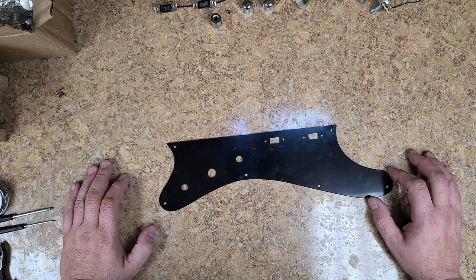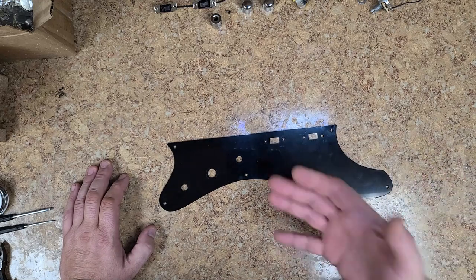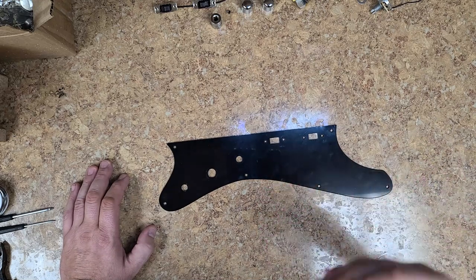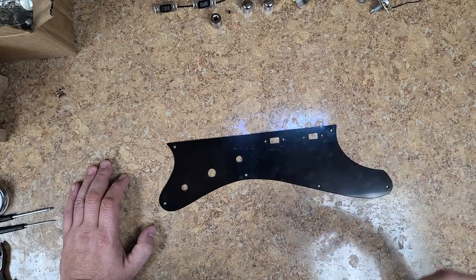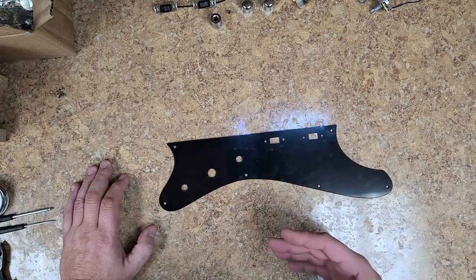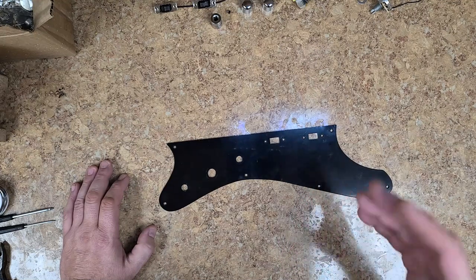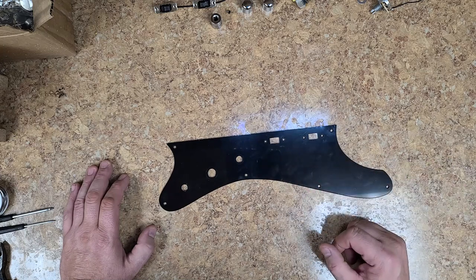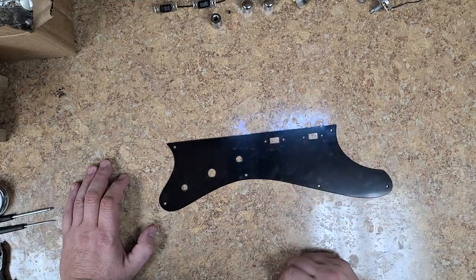So what we found is, I was kind of messing around a little bit, using a little bit of rubbing compound actually worked a lot better. The only problem with it is some windshields have a UV coating on them, and you don't want to remove that UV coating. So that's probably what makes it safer to use what's recommended on those. So if you're a biker, I would try to talk to your Harley Davidson dealer about what to use, because again, some windshields have a UV coating on them and you don't want to remove that. So this, I don't have to worry about that, and I'm going to use rubbing compound.